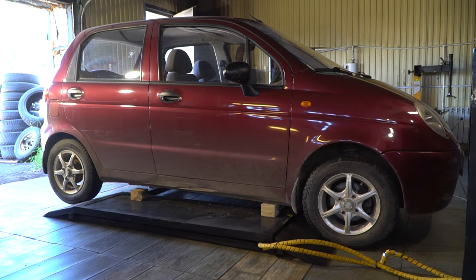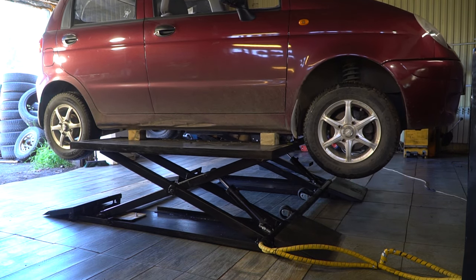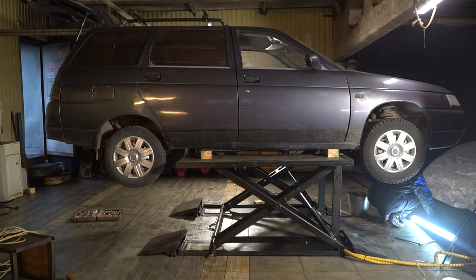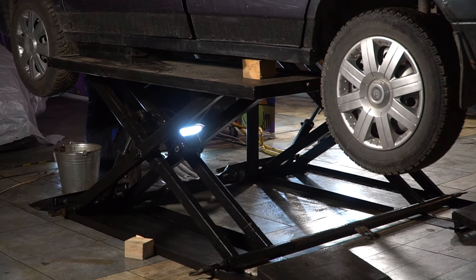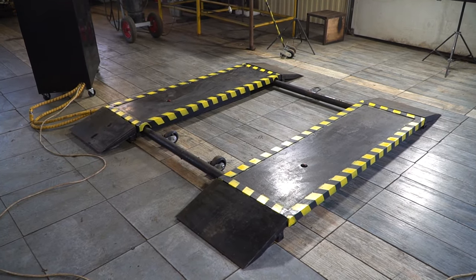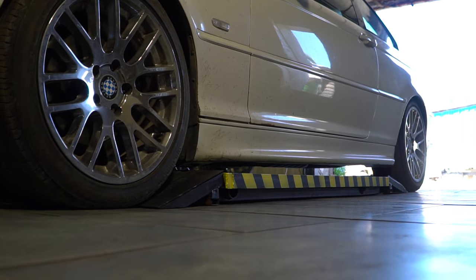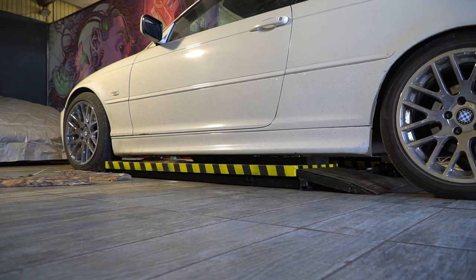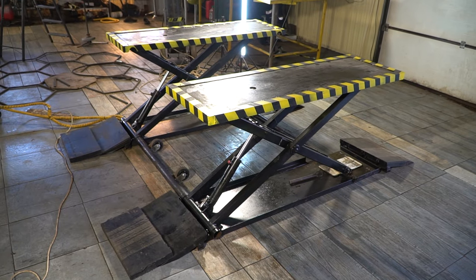The lift turned out to be a very useful thing. I'd hardly painted it before several cars had already been repaired on it. The jack easily lifts small cars and light sedans up to 1,100 kilograms. It would be interesting to know whether it can raise a car with more serious weight, like 1.5 tons. The 4-ton cylinders are still weak — this was clear from the beginning. We need to put 6-ton cylinders on each side and test again, which will be done in the next video. Thanks everyone for your attention, don't forget to subscribe to the channel.